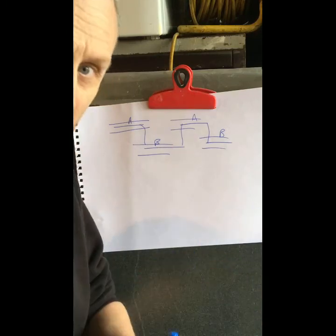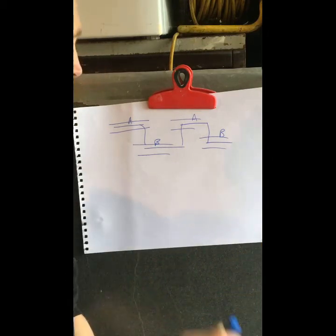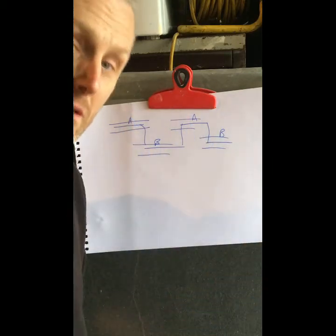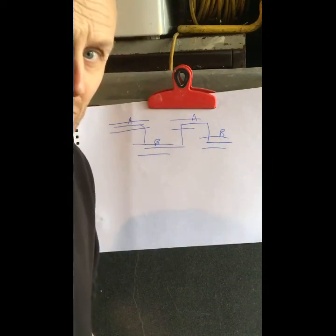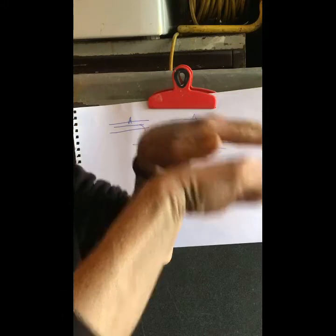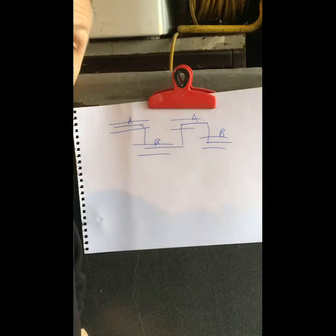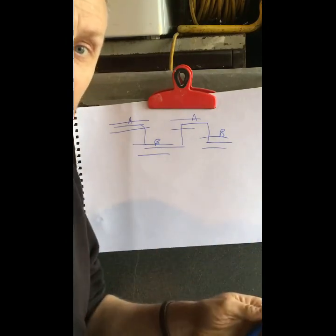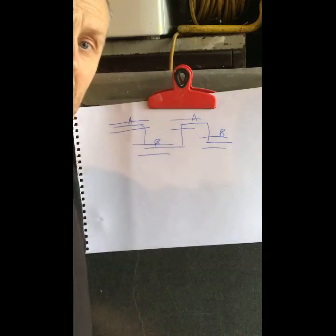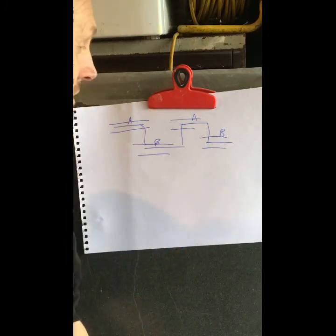And it depends on the strength of the unit, the length of the track circuit, the frequency as well. Different frequencies, different sounds. But that's what the warbling sound associated with the track tuning units is about. You will hear this if you ever work on a track that's digital, TI-21 or Asters, especially Asters. Asters whistle quite loudly, but that's what that is. It's looking for that up and down, that high and low thresholds on its frequencies as part of that track circuit. So whilst there are 4 key frequencies for the track circuits themselves, they have threshold values between the high and lows that the system must look for. Outside of those, that's it. The system says, I'm not happy, and drops the track. So again, safety related.